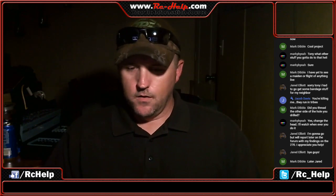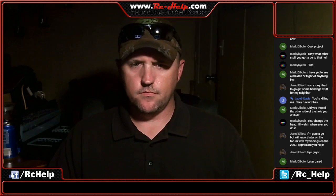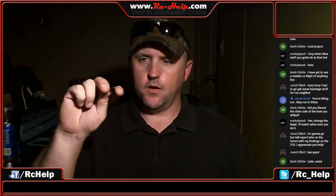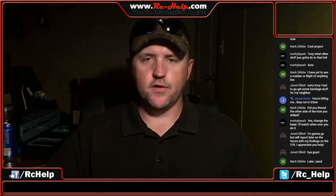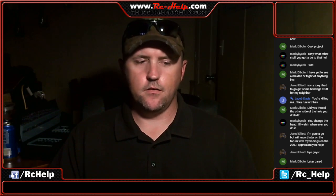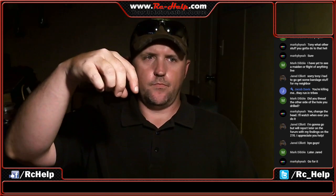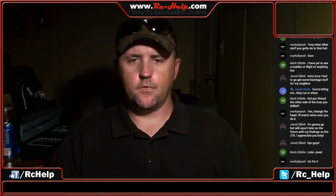Okay. So yeah, I've been waiting for the comeback from Mark. I don't know if I want to put this head button back on. The feathering shaft was threadlocked and it was put together really well, sans the grease. But the head button, that bolt had no threadlock on it, so you will probably lose the button in flight if you don't put it on, because it would actually back out. Go for it. Okay.